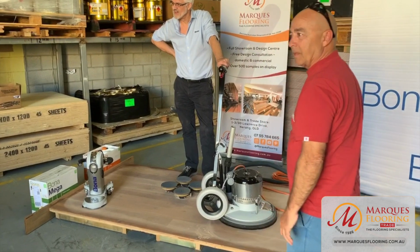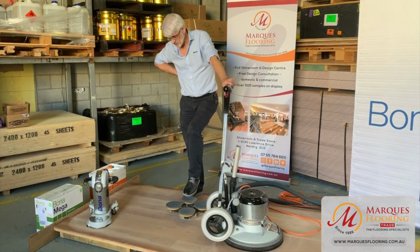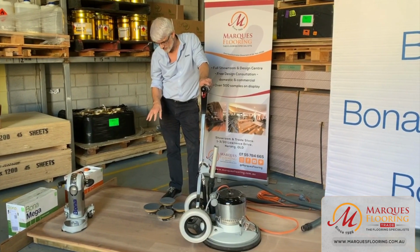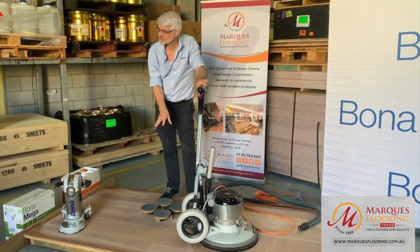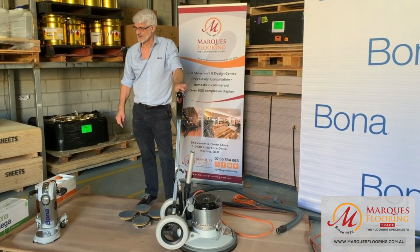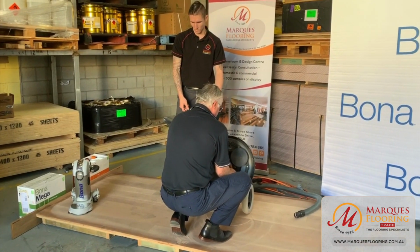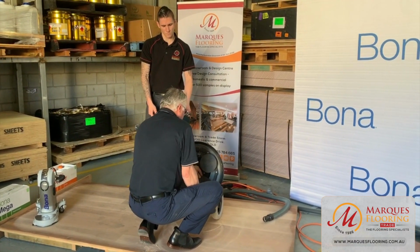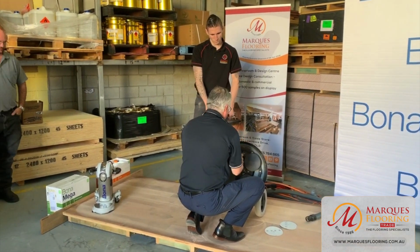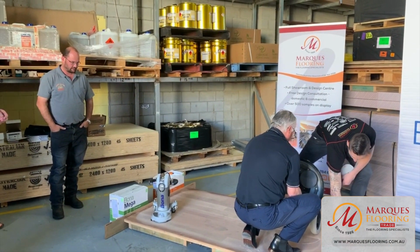Can you finish that with 100, or at least do half of that, so we can see the difference? Well, what you could have done with this is just put 4 60s and then 2 80s and 200s. Can you show? Yeah, we can do that. It does perform just as good, if it's an old polyurethane floor with 3 or 4 coats. It's amazing actually. If you just go over 2 or 3 times with the 50 grit ceramics, it rips it. It just goes through it.